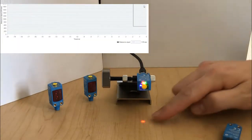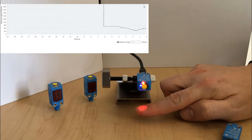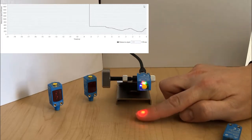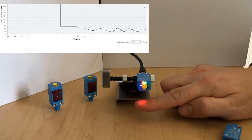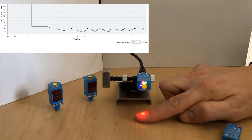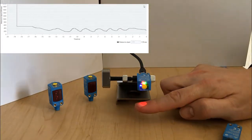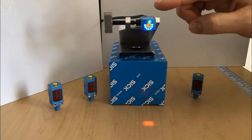The sensor also can measure distance to an object. That's unique in a proximity type background suppression sensor. Normally we're only looking at longer range time of flight sensors to do this, but in the short range, less than 6 inches, this background suppression sensor is going to be the most accurate of any sensor you would have in a distance measurement sensor short range.